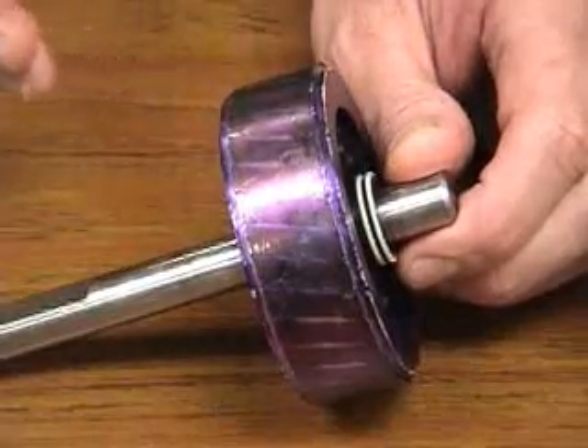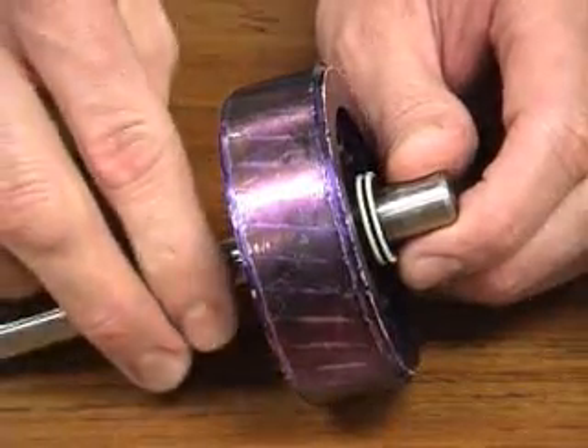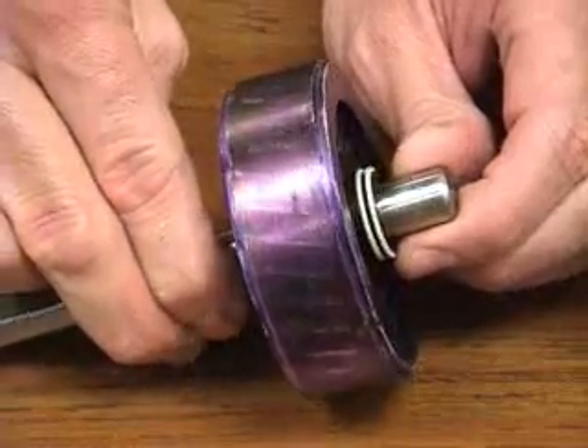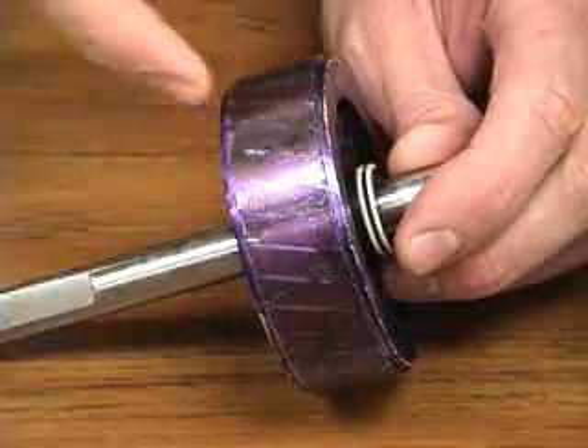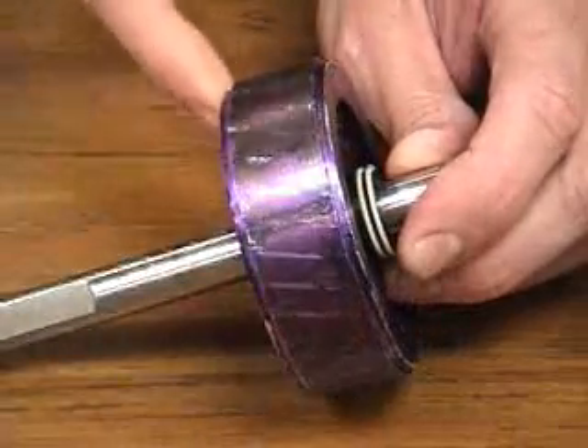The lines are on a slant, where the bars are angled in order to develop startup torque in this particular single phase motor. The actual rotor bars are shorted out on both ends by shorting rings.